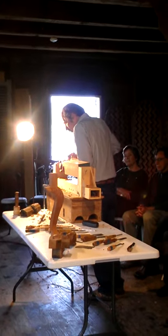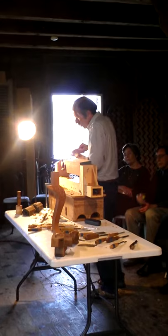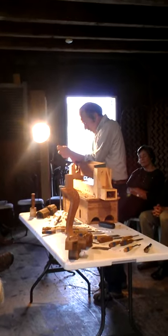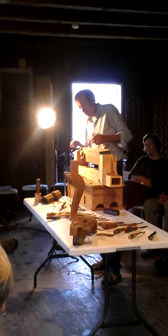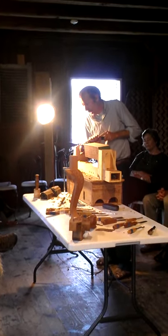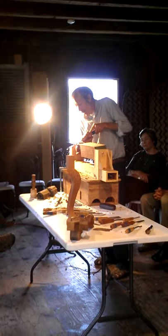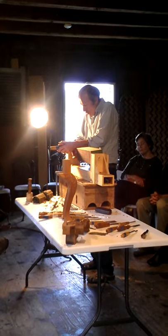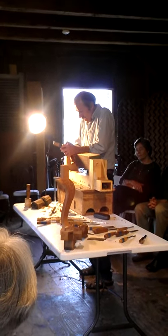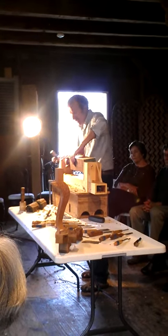When you look at old furniture, the stuff that they carved, they used nice, smooth, kind of boring wood. Whereas something like a tabletop — something more front-facing — that's why they used the fancy wood. But they used nice straight-grained wood for carving because you really don't want highly figured wood for carving. The grain is not unpredictable, but it's not straight, so you have to constantly switch back and forth to accommodate for grain direction. This piece is pretty much a nice straight piece.